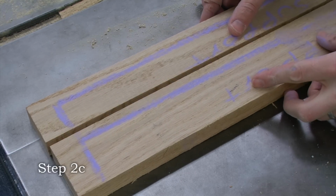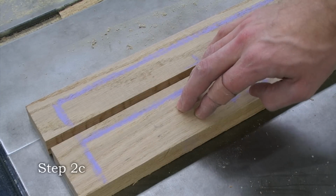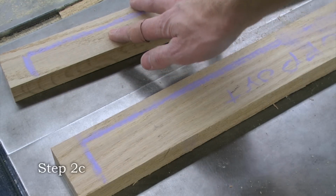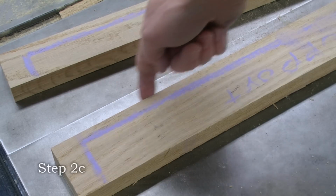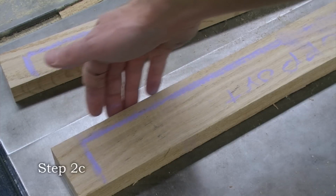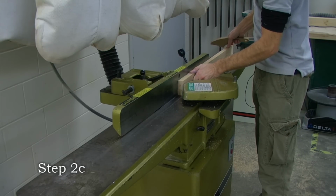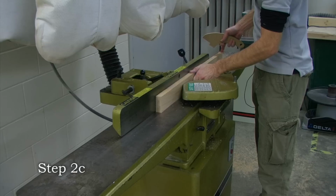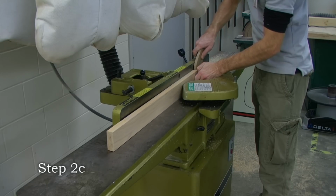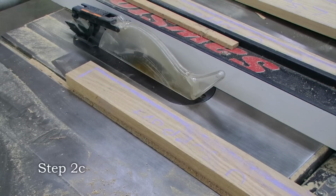Now, on the table saw, I just cut this 2 1/8 inch board, and I'm going to be cutting another one out of this piece. My jointed edge is along this side, and that was up against the fence. So I cut this piece and that one is done, but now I have mill marks on the inside of this piece and it's no longer perfectly smooth. So I'm going to joint this edge again before sending it through the table saw so that I have a perfect edge up against the fence. Now I have a nice perfect edge to run up along the side of my fence.